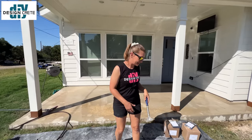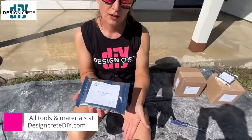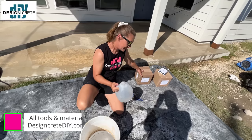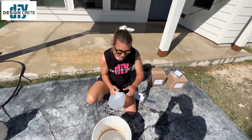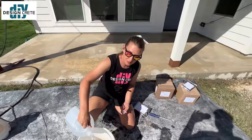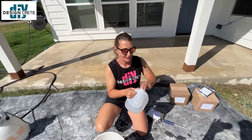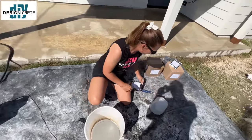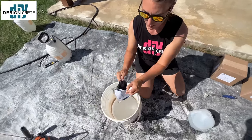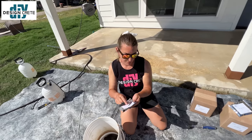For our base coat, we're going to tint it black — that's going to give our wood look some depth. If you're using tint, you've got to mix the color pack with the water before you put in your base coat. One box of base coat takes one gallon of water max; you'll probably use a little bit less. I'm going to start out with about half a gallon. Everything is already pre-measured, so it's one pack to one box.